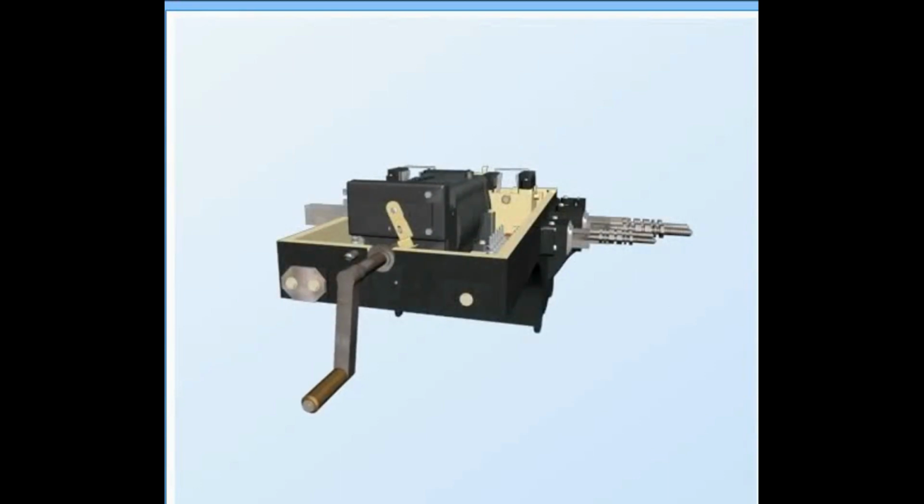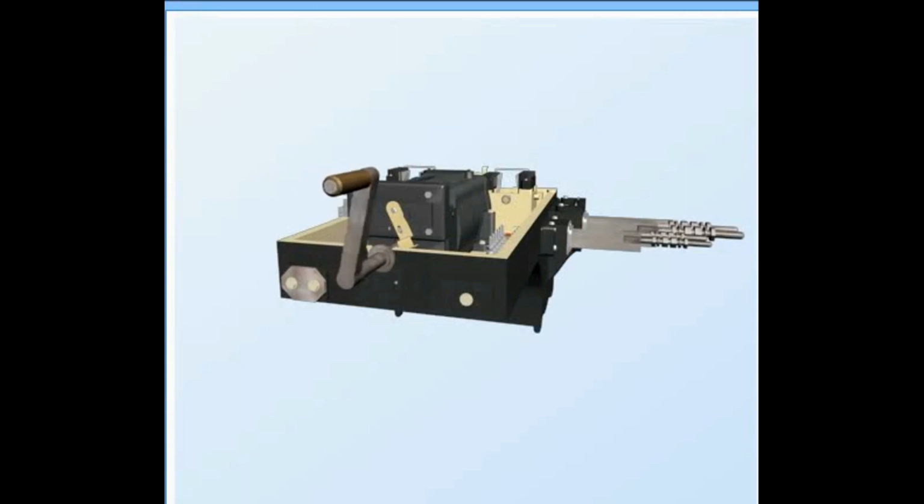Insertion and operation of crank handle key cuts off electric feed to the point motor and makes an opening for insertion of crank handle. Now, with the help of crank handle, motor shaft can be directly moved, setting the point to any side. For power operation, crank handle is removed and steps 2 and 1 are followed in reverse sequence.